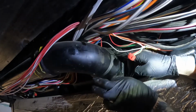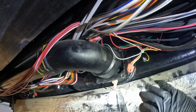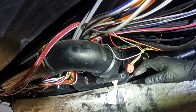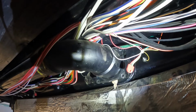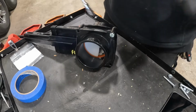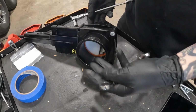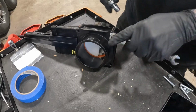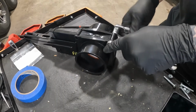That's great. So from here, I'm actually gonna let this sit for a while, and that's just gonna drain down into the shop drain because I'm not gonna sit and work underneath it while it's like that. I recommend you do the same thing and try and keep yourself clean. On the new valve, you'll notice when you open it that you're gonna have the flanges that are typically glued onto the pipes that are down there. You're not going to need those because you're not replacing them, so you'll have to take the 4 bolts out of here as well.